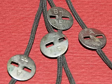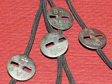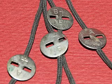This radio still has all its tags for hooking it up to the batteries. There's A- and A+, which is for the WD-11 and WD-12 1.5 volts, and the B+ and B- is 22.5 volts.